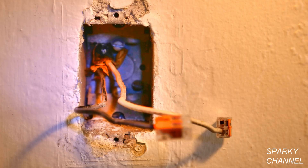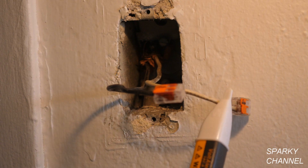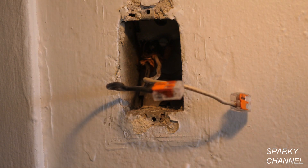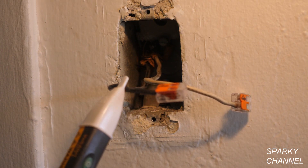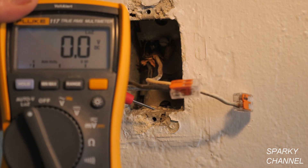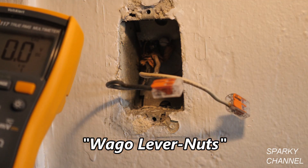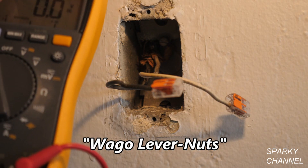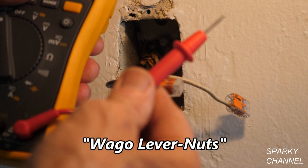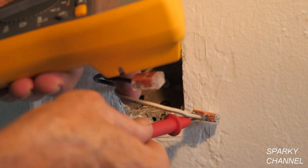I have now turned back on the circuit breaker to make a couple of important tests. This is my Fluke voltage detector again — this is the hot wire right here, so this is what we call the line wire, and this is what we call the load wire, the wire that's going to the light because the light is the load. This is my Fluke 117 electrician's meter. I have these Wago lever nuts on these wires for safety because the electricity is on right now for this test. I'm going to take the red lead of my Fluke 117 and put it into one of the ports of the lever nut.